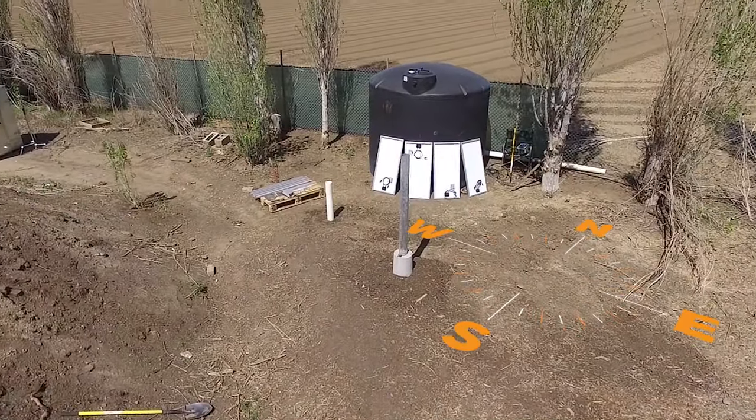The pump has three wires coming off of it and it comes with crimps already attached. Before we do the crimping, we're going to slide the shrink tubes over, perform our crimps, slide them over the crimps, and then using a small torch we'll heat them up and let them shrink down. That inside adhesive is like a hot melt glue — it's going to melt and ooze out the ends making a nice waterproof connection. There are wire numbers on each — one, two, and three. When you do this crimping, if your drop wire colors don't match up exactly, you're going to want to write in your instruction book the pump wire to drop wire color code.